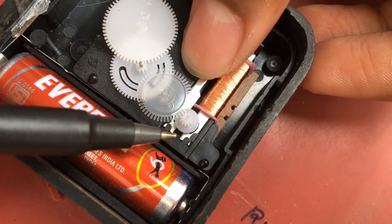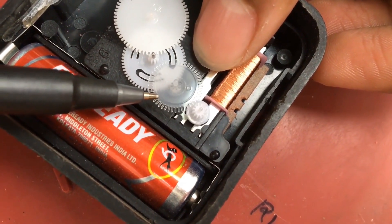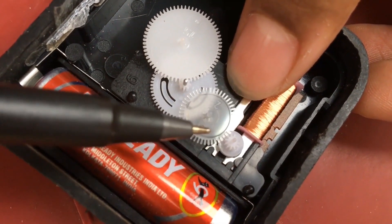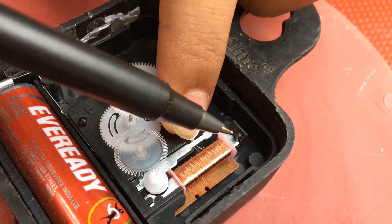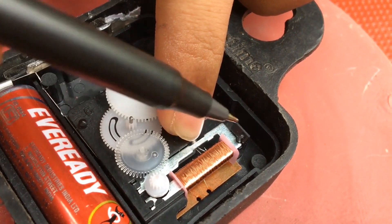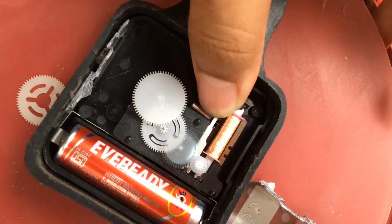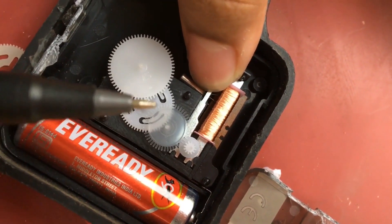Now we can see that the electric signal of frequency one pulse per second is ticking, and that signal is transferred to these white gears. These gears make the hands of the clock spin. Here we have a copper coil, and inside the stepping motor coil we have a magnet — here an electromagnet is used. A stainless steel plate is placed inside the copper coil, which is made into an electromagnet by virtue of a current passing through it. So now the circuit is functioning properly and the stepping motor is also doing well.